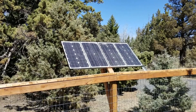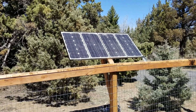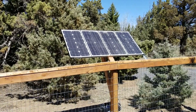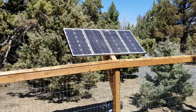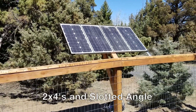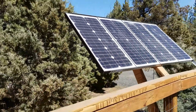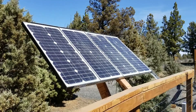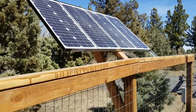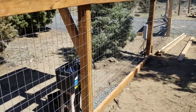We mounted our solar panels directly onto the 4x4s and fence posts to give a nice solid base. Alico does not automatically include mounting hardware and posts for the solar panels, so we used some ingenuity — 4x4s and metal railing — to create a mounting system that makes a really solid base. We've got them mounted at a 45-degree angle pointing due south, which is recommended up here in Oregon, with the battery box just below and the control panel about eight feet away.